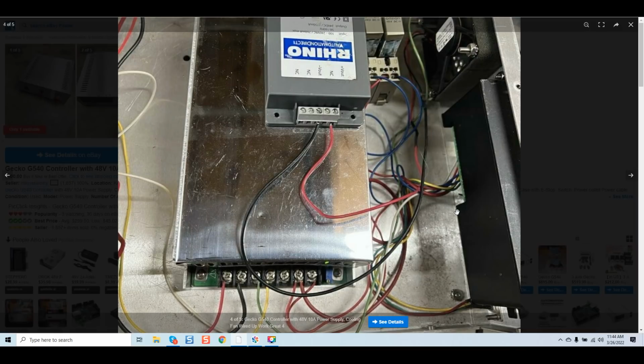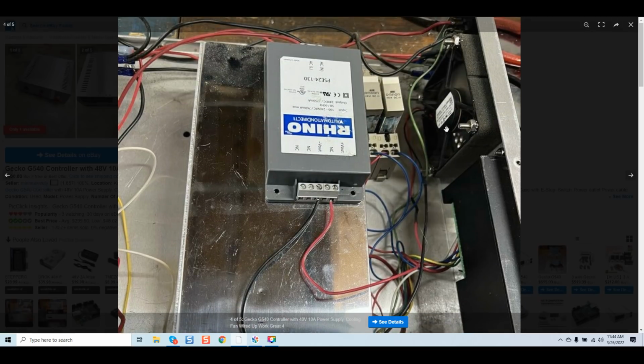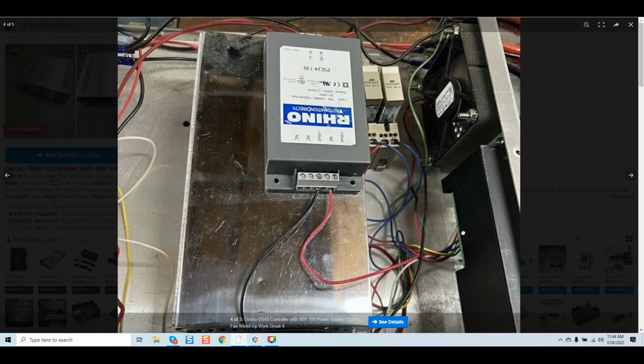worry about. Okay, first of all, we see he's got a fan here. He's got no heat sinks on the G540. So by not expanding the G540 surface area, you're really only going to get limited cooling effect. In this actual mounting pattern, actually it's opposite. He's got the fan blowing air in. So realistically, if you were to not mount heat sinks on the 540, optimally you'd have the fan blowing air out. And this way you vacuum out all of the hot stagnant air.